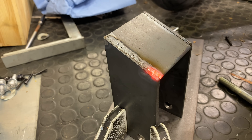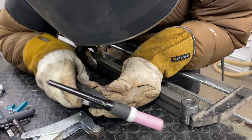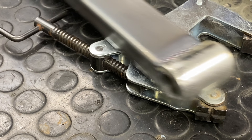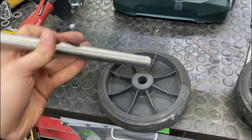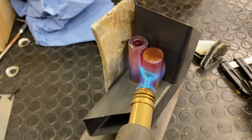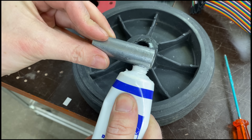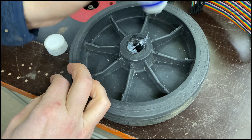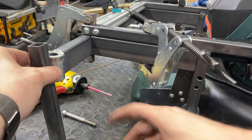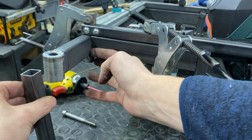So I built some brand new casters. This time I had steel on both sides of the wheel to support them better. For the swivel mount I used M16 bolts that fit perfectly in these standoffs that I had left over — very handy because I don't have a lathe strong enough to drill holes in this size. I welded them to the spreader bar. I've got this axle shaft that fits perfectly but these are hardened because they're made for precision machines and it's very hard to drill a hole in them. So to soften this up I'm heating them up until they're glowing red and then letting them cool down slowly so hopefully the hardness will be gone. That didn't work at all, but I found out that wheelbarrow axles have the perfect dimensions for this. When there's a wheel attached it wants to twist this bar, so I'm welding on a support and then I can screw this to this so later on I can still remove it but have a really solid connection to the rest of the frame.